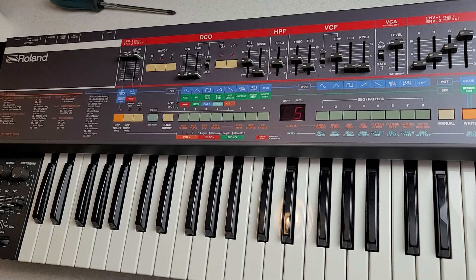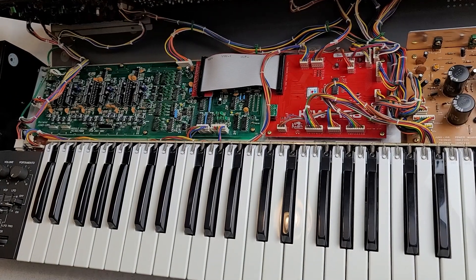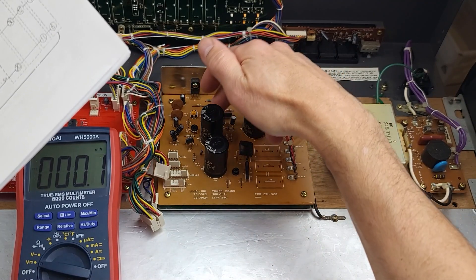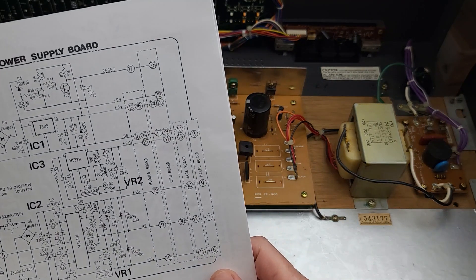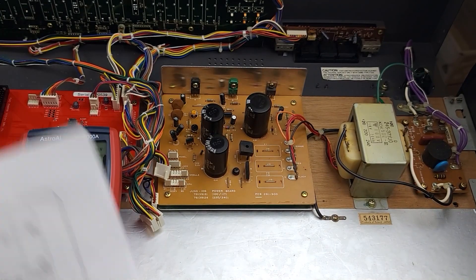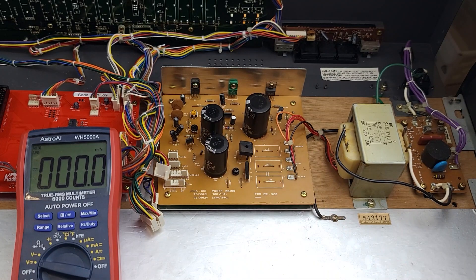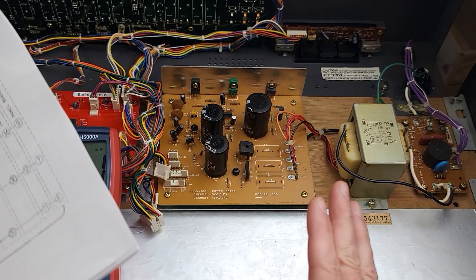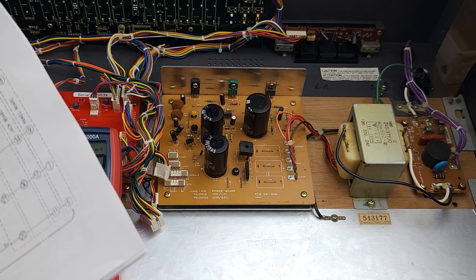So I am going to turn it off and unplug it. I learned the hard way — remember when I was working on this before, I gave myself a mighty jolt by touching one of those hot terminals over on this side. This 5330 along with these two transistors is the analog side, which has quite a few different voltages it produces. This... Ow! Ow! Son of a— By the way, don't touch a transformer when the power is on because that's 120 volts. That really hurts. So I'm always talking about how you should be careful doing this kind of work because there's lethal voltages — and yeah, that's why. Don't do what I just did.